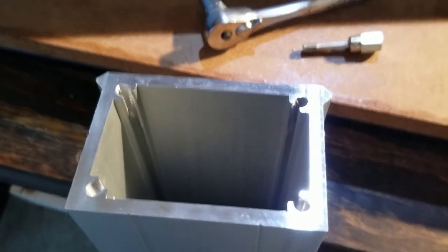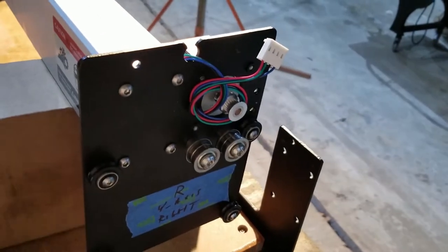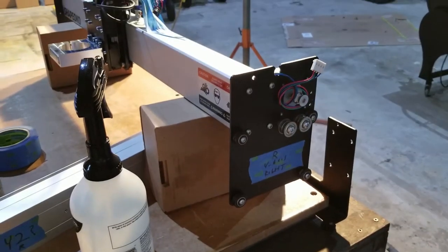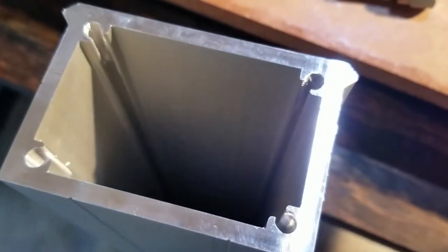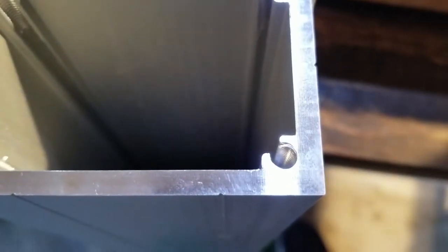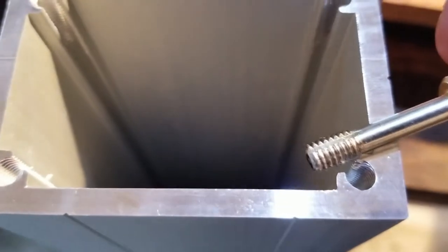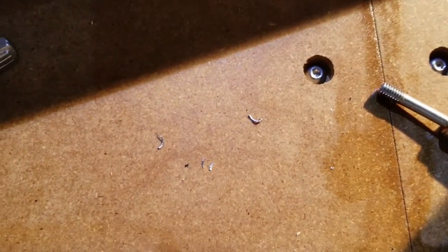So be careful with these things. Make sure to clean them all up before you try assembling them, because that aluminum and these end plates are kind of heavy. If you're doing it by yourself, trying to balance everything, everything's going to turn out bad. This is where you need help - someone to hold the plate while you're trying to get the screws aligned, especially without that taper. Out of four holes, three of them have shards. This tool basically has got little cutters in it that will clean out all that junk, and that's what I've been using to pull out all that stuff.